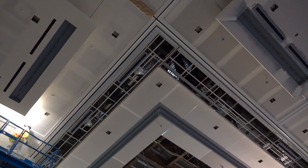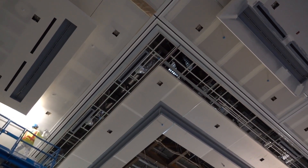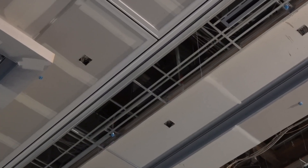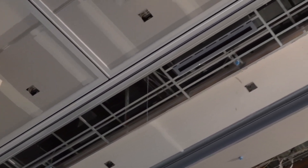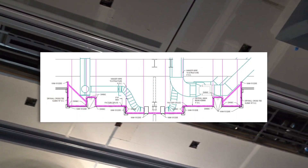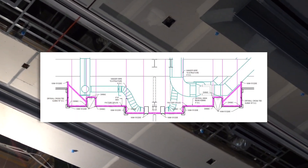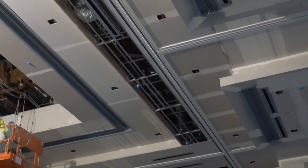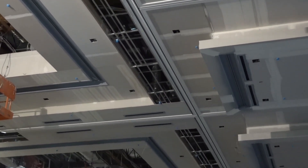If you look up here, that's a great combination. They used a combination of our different tee spacing — four and six-foot spacing — so they didn't have to cut the framing for the diffuser boots. When we're jigging these up as a frame, that's essentially a truss, and you don't want to cut that truss because you're cutting your strength. So they used a combination of tee spacing to minimize the cuts. It's a great idea.